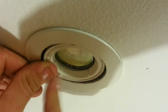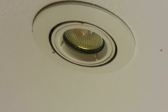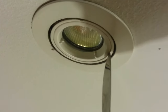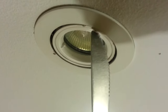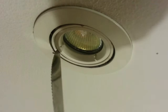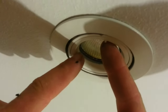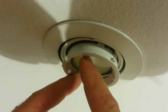So your next option, if that fails and it still can't come off, you can get a butter knife and try to jam it in between, give it a bit of a wriggle. On the other side, a bit of a wriggle, just to try and free it up a bit. Once it's been freed up, one finger on one tab, one finger on the other tab, you go in opposite directions and pull it around — it'll come out.